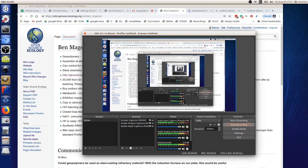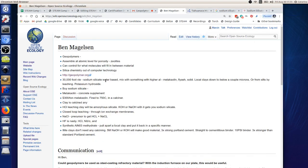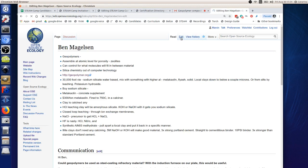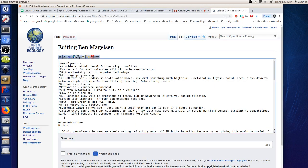Bound to the aluminum silicate network, the alkali metals are bound inside of these aluminum silicate cages where the cations can't come out, so they're chemically stable and don't react. If you do an ASTM test with chloride impregnation that they do for normal Portland cement to estimate lifespan, these materials test out to well over 500-year lifespans — 600, 700, 800 years — because they're more chemically stable.